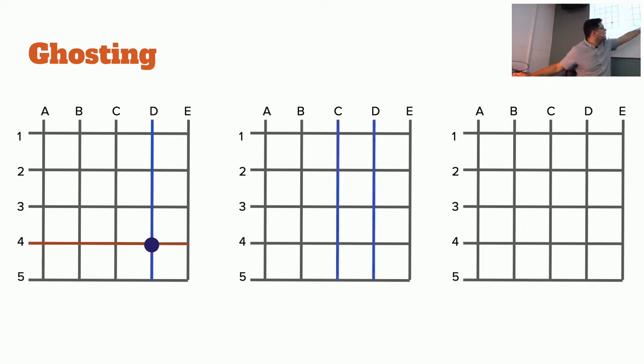Let's say you're going to press two keys, and they're on the same row. So then you have two keys that activate. That's fine. It can identify them. They're the coordinate system, right? But now let's say you're going to hold down three keys, right? So you've got two keys being held down, and one additional key. Two of those keys share a row, and two of those keys share a column. And so which of the four are going to be detected, right? You could be pressing these three or these three. Unless your firmware has some crazy way of detecting all of these key presses, it's not quite possible,